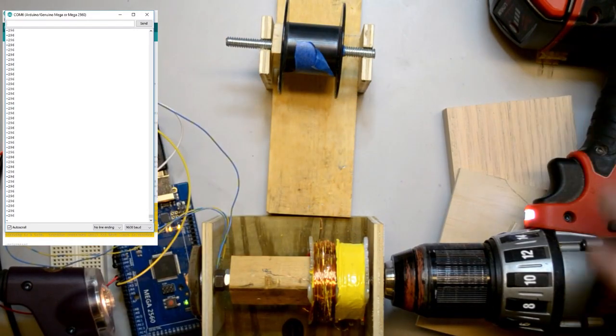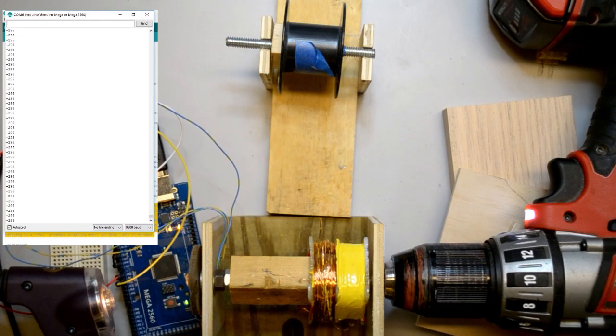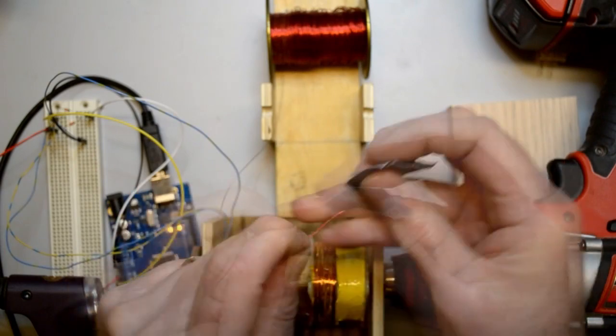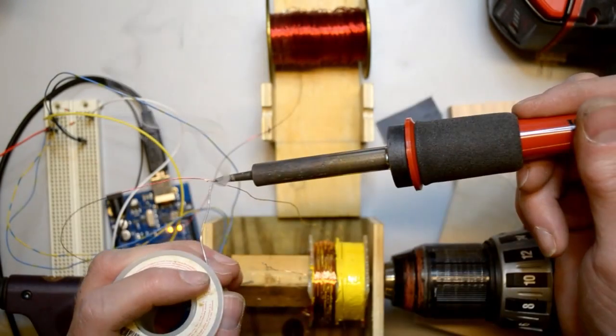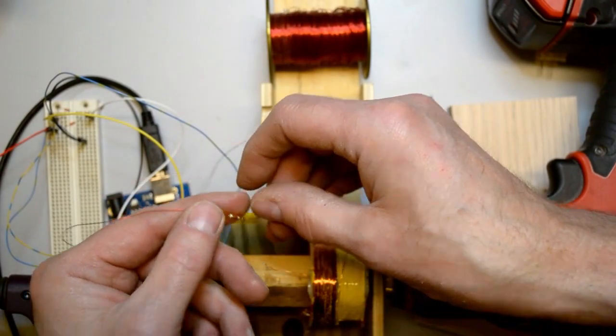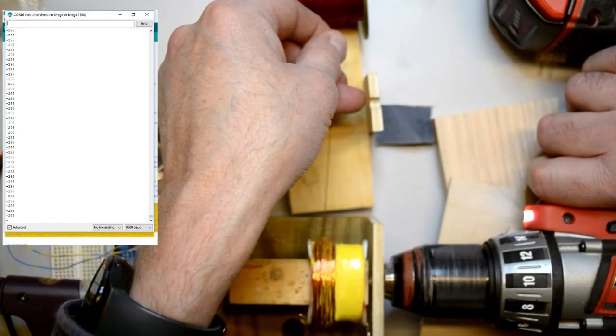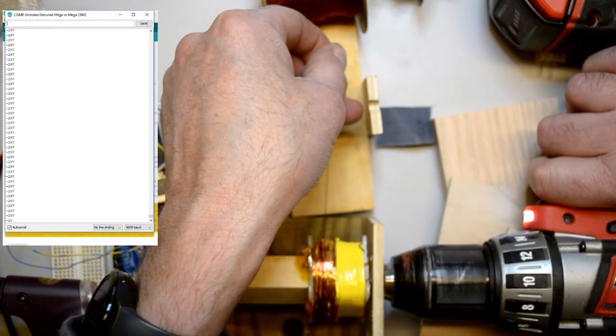I ran out of the original wire and had only put back 296 of the 310 turns I had taken off. The coil looks bloated — I guess I should have put more turns on each layer to minimize the amount of empty space. Oh well, this was my first transformer rewind. In order to reach 310 turns, I will have to add more wire. I found some magnet wire that is a little thicker than the original wire on the coil. I cleaned the end, soldered it to the original wire, and taped the joint. Then I added another 14 turns.